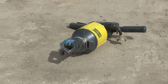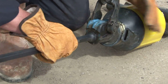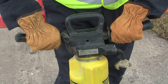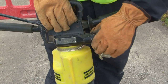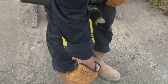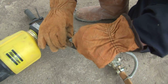Whenever fitting the working tool, switch off the air supply and bleed the machine by pressing the start and stop device. Disconnect the machine from the power source. Lubricate the tool shank with grease and check it's free from grit and dirt. Close the tool retainer and check the lock function by tugging the inserted tool sharply outwards. Check the handles for excess wear, check the air inlet is tight and the rubber is good, check the lock nut, make sure the muffler is tight, and make sure the kick latch retainer is locked in position. Then connect the short hose with the whip check to the rock drill.